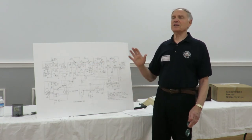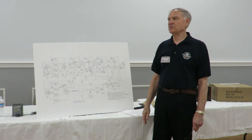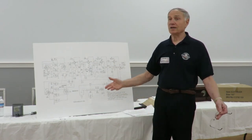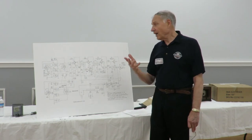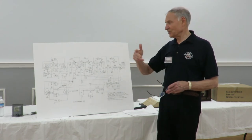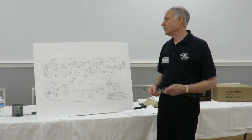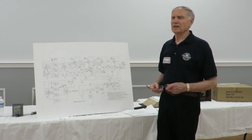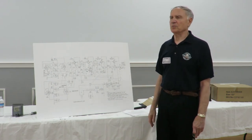And I don't know how Zenith did it, Zenith Transoceanics, but they're incredibly sensitive. Those vacuum tube radios, I don't think it would be any better. I don't know how they did it. You don't think it has anything to do with alignment, do you? Well, I've seen that too. We went to one flea market once, and a guy had a Zenith there, and I took it home. I think I replaced one tube, but I did the alignment. The alignment just incredibly increased the performance of the radio.